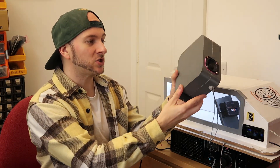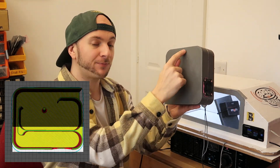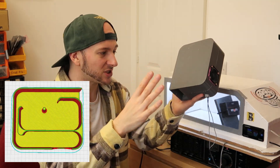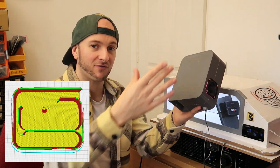The way that this enclosure is supposed to work is at higher frequencies, the driver sees just this first chamber and this port loads at higher frequencies. And the output from this port is channeled through past this second chamber, which is not supposed to really change the sound at all.